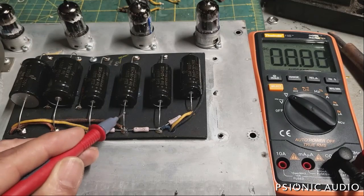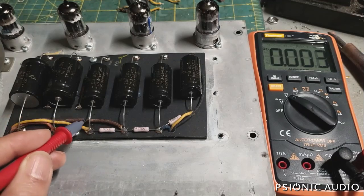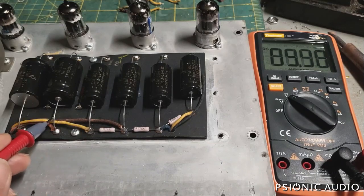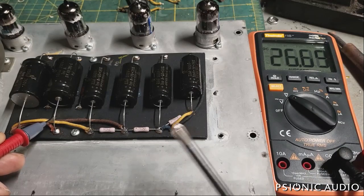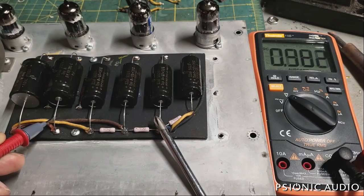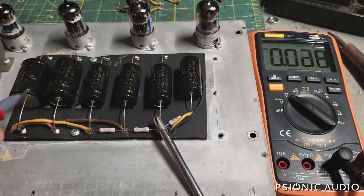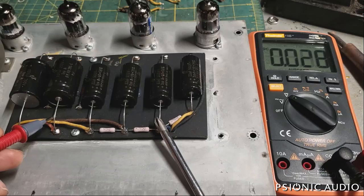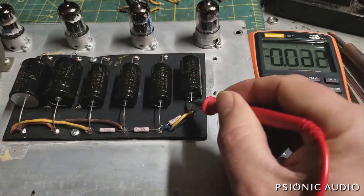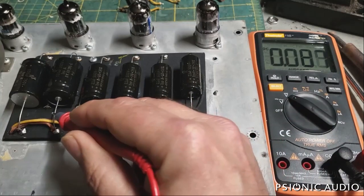You see how this has gone to 35 volts even though it's not plugged in — that voltage was stored in these caps and it's come down. I've got the amp powered off but the amp is out of standby. We've got 26 volts there and it's dropping. I'm going to hasten that drop — don't do this unless you really know what you're doing. If I had more substantial voltage I would use an alligator clip to a very large resistor. But because I have these bleeder resistors that balance out the DC voltage on these capacitors, I can bleed the amp down to zero fairly quickly and safely. Now these capacitors have essentially no voltage on them.